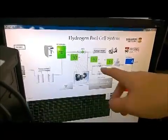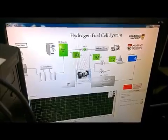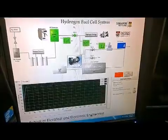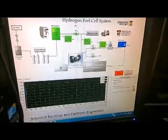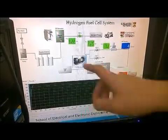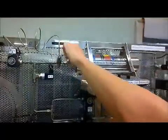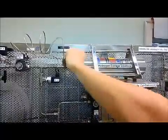We have to wait until the PSI of the hydrogen storage is about 180, which is the maximum cap level. When the PSI has reached a stable level, it shows that the hydrogen storage has been fully charged. At this point you can turn off the H2 generator and close the valve, making sure that you close the valve to the hydrogen storage as well.